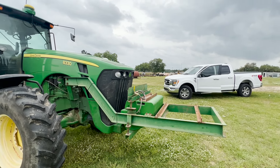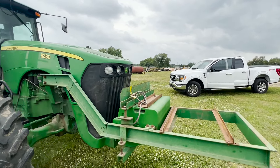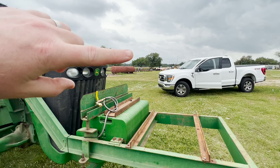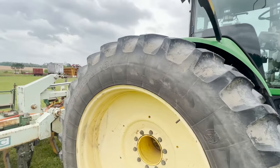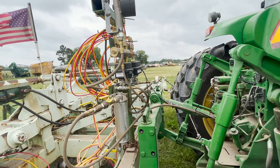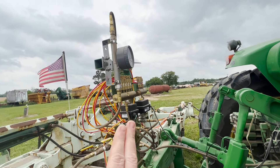So, just to walk through the rig: the steel cylinder — what we would call a pig — would be on this front rack, hooked also to a nitrogen cylinder. Nitrogen would pressurize the tank. If this were hooked up, the tank would be sitting here. This rated hose would run into the chloropicrin cylinder. Nitrogen would push it out down this line, up into here, through a filter, through a series of flow meters, valves, and sight glasses. Basically, all the calibration would be happening here.